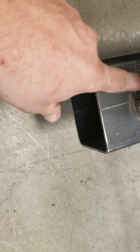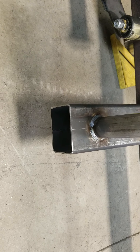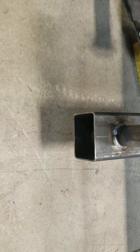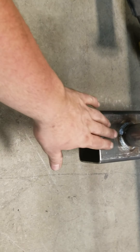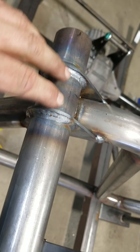This is a three-by-four frame rail car. You can see I got the tubing come down to here, but look what else I did — I bored a hole here and actually dropped the tubing right on down in there. That way, if this car ever takes a hell of a side hit, the tube will never come loose. It's bored right into there and just makes it a hell of a lot stronger.